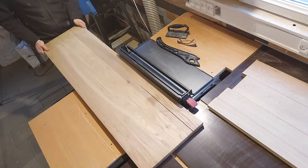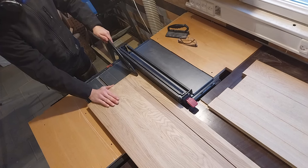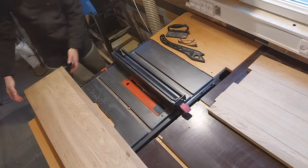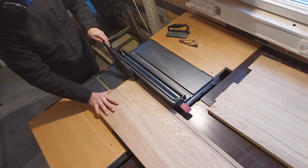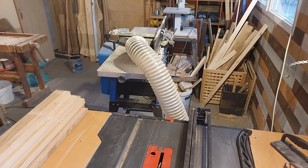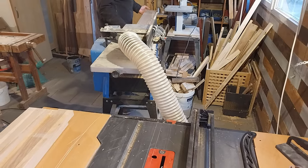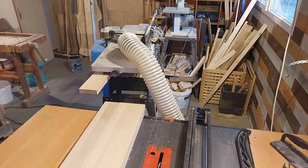The first thing I had to do was to rip it into pieces and cut them all to the desired width. Since it didn't need to be super precise, just what I thought would fit well behind the sofa. The wide boards will be the shelf top, while the narrow boards go under and become part of the structure. After ripping them, I ran them through my thickness planer and got them looking fresh.